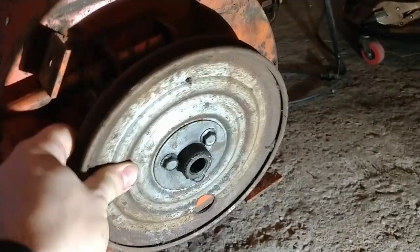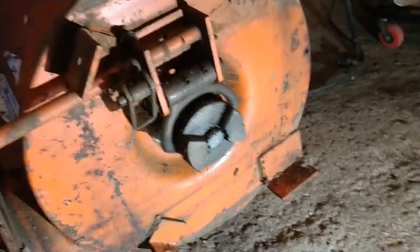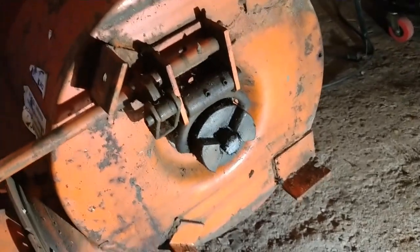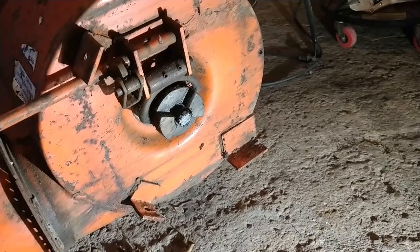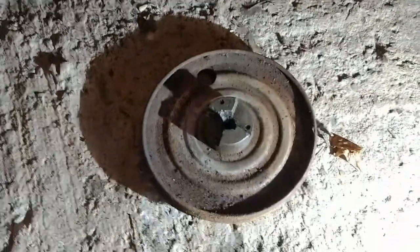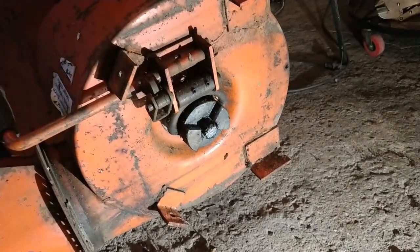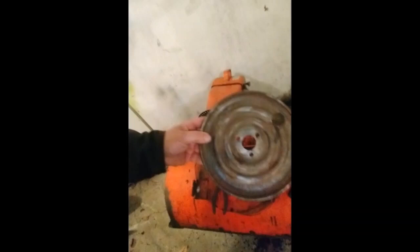The first order of business is to figure out how to mount this pulley directly to the auger shaft. The snowblower originally came with a disengaging lever — there's kind of a knuckle going on that engages the pulley. I have to figure out how to make that spline mount directly to the pulley, directly to the auger. The solution is to mount the pulley directly to the piece that has the splines on it.